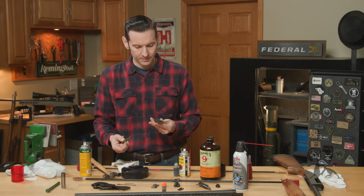Firing pin will go into the rear, into the locking block, into the spring, and that bulge on the firing pin there will kind of want to get in the way. So, alright, and then there's a cutout in the front of the bolt for the spring and firing pin to go into. Alright, now you need to make sure your clearance cut on the firing pin is on the same side of the hole in the bolt.